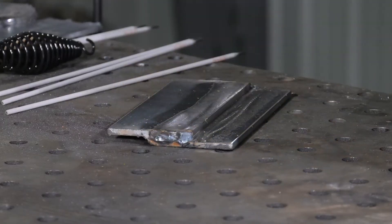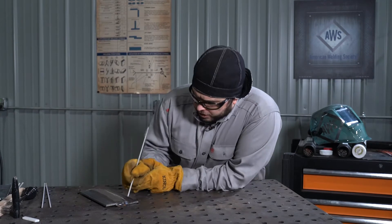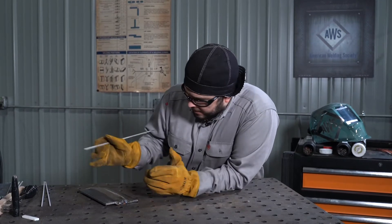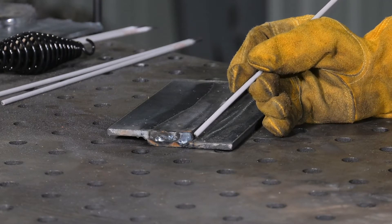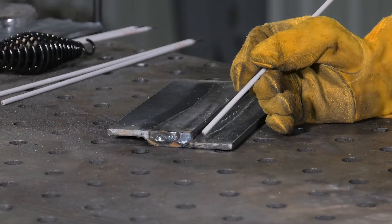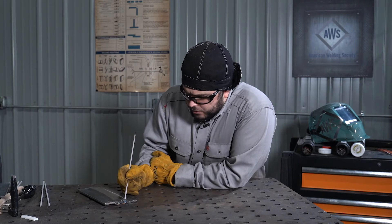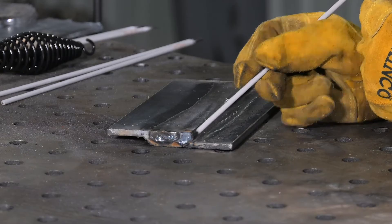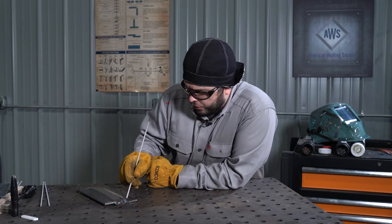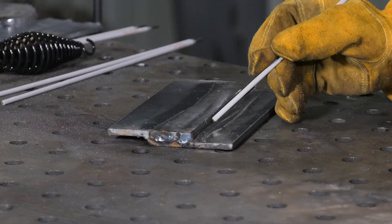The lap weld with E7018. We got quarter-inch material, mild steel. I've gone ahead, removed the mill scale. To accomplish this weld with the E7018 electrode, we're going to strike the arc off the tack, which I've already fit this material together. Once we get that arc established, I'm going to make my motion a very slight side-to-side, watching the molten pool catch the top corner of the top plate here and trying to uniformly tie it in to the base plate. Making sure I'm keeping a tight arc, I'm going to come at this with a work angle of about 30 degrees and a travel angle of about 30 degrees as well.